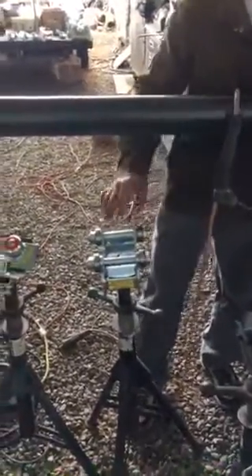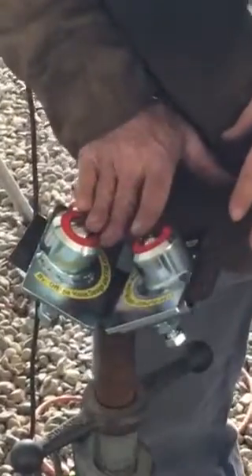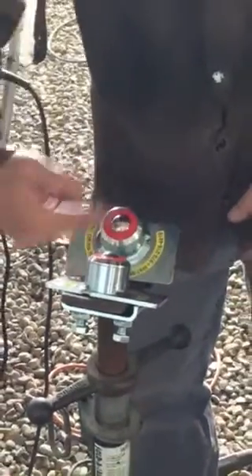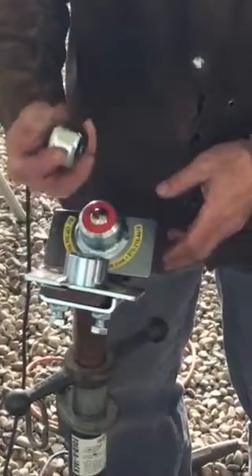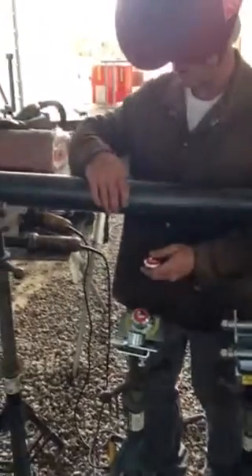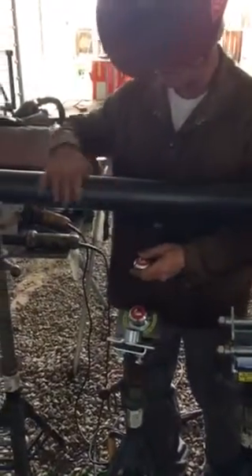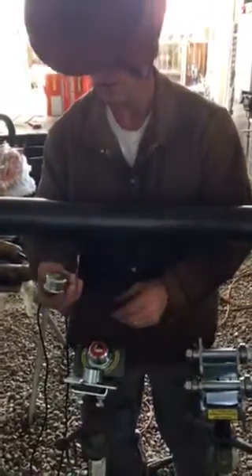You want to support your pipe out here — these are super smooth and can hold more capacity than the jacks. You can put thousands of pounds on these and they still roll smooth. This is another style I make with all stainless balls; you can slide pipe back and forth as well as roll. These make a great support. They're billet machined, they don't flex or creak when you put a bunch of weight on them. The problem with some others is mill scale and dirt gets in the balls and clogs them up — these have multiple weep holes so they're kind of self-cleaning.